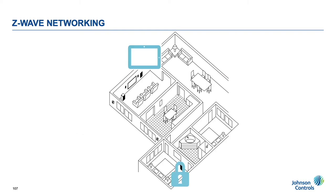Understanding Z-Wave networking. Z-Wave is a mesh network where signals from devices can hop like stepping stones from one to another. In this example, we'll show how to create a path from the IQ panel to the door lock using devices in the network. We'll also show what happens when the thermostat connection is lost, how the network breaks, and how having other devices on the network can create possible alternate routes. Remember that in general, devices that operate on battery only, like locks and sometimes thermostats, will not act as repeaters in your network. In general, devices that have constant power, such as lights and sometimes thermostats, will act as repeaters in the same network.